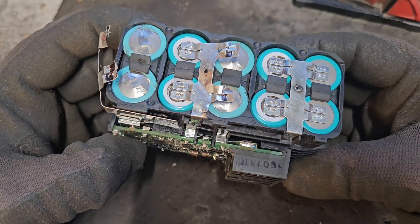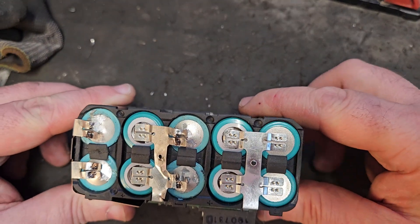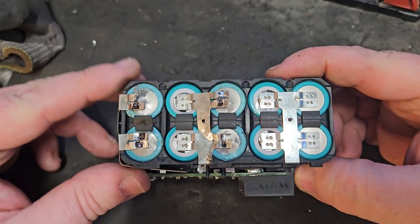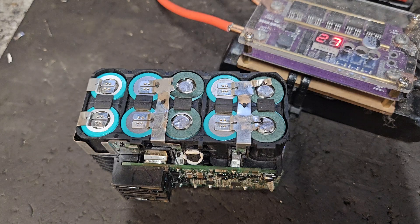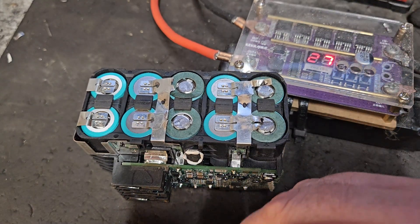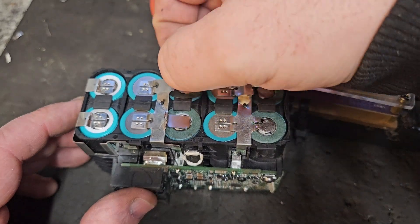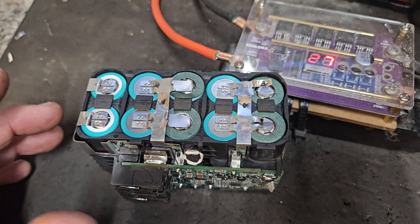To do this you use both a spot welder and a soldering iron. You can solder directly on the cells but I don't recommend it — the heat can damage the cells and can also cause issues like the battery catching fire. The safer way is the way the manufacturer does it: spot welding. This here is a spot welder — a DIY one I cobbled together myself, but there are all sorts out there. What we use to join the cells to the battery is this nickel strip — I cut bits off and spot weld them on.